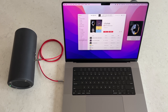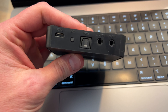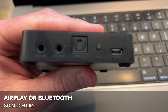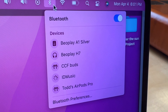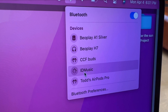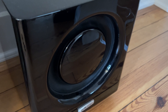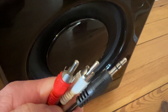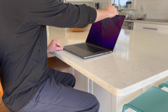The last thing I wanted to try out is a wireless setup. However, in my testing it didn't really pan out, mostly because when you use a wireless protocol it introduces latency — the subwoofer would be playing slightly out of sync with the main speakers and it really muddies up the sound. Remember, you can try this now with any powered subwoofer you have lying around using a 3.5mm to RCA cable like this one. Give it a try before you commit to something like the MiniRig sub — and honestly, if you're just using this on your desk, a full-size sub will sound even better.